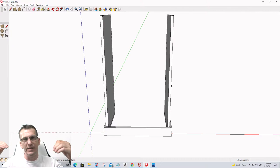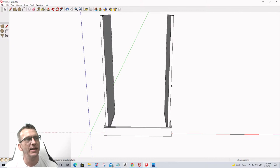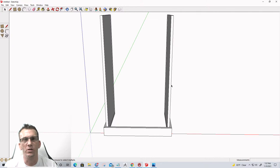I hate drawers that only open partially and you have to freaking dig back there and stuff. Even though this is only 15 inches, it's not that wide. It's one of my biggest pet peeves with furniture. I want a full pull. I want access to my whole drawer. So I'll most likely be using mechanical slides. And so on those sides, I'm probably going to make little pilot holes. I'll probably use a V-bit and just identify that with a drilling tool path, the pilot holes where those drawer slides are going to go. But on the outside, I want some decoration to this, so I want some nice looking side panels.